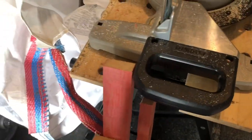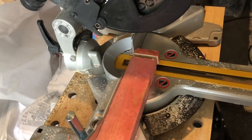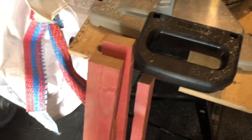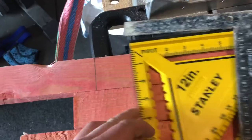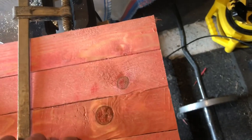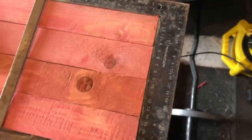Let's get on with measuring. First of all what I've done - I've taken the circular saw, which does a really accurate cut, and I've cut just about 10mm off each length of wood. These all measure over 700mm so we've got a nice square edge for the tables to sit on. I want a square edge at each side so I'm going to show footage of me cutting these to 700mm. We've marked the first piece of wood at 700mm, got an F-clamp loosely clamped with all the pieces lined up with square edges, then put a little T-square on them.